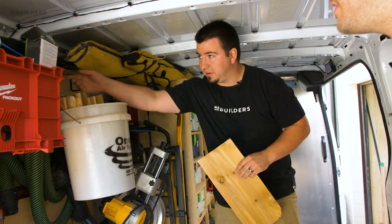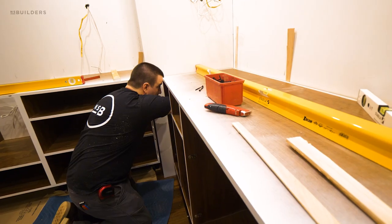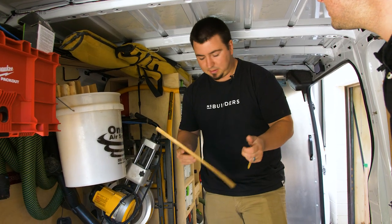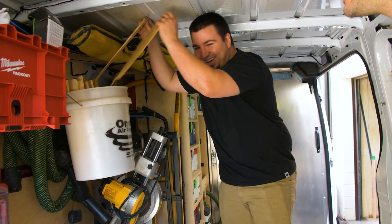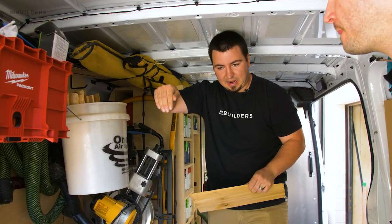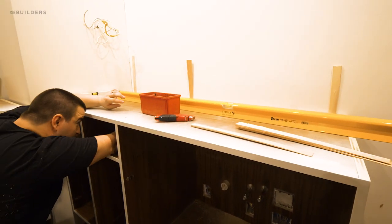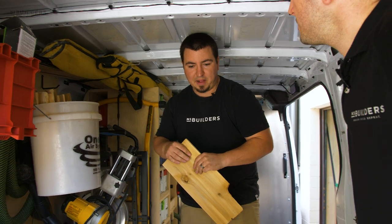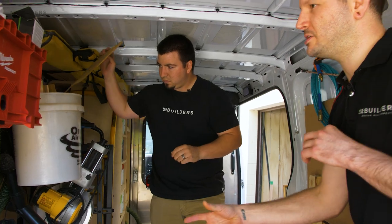When your cabinets are going to be tilted out off the wall but they are level and plumb, you never want to screw it to the wall without something behind it - whether that's a flat piece for a consistent gap, or I have some eighth-inch stock up top for that. Generally speaking the wall is going to move around a lot, especially on long runs of cabinets. We'll either cut these shims or break them off in pieces and make sure they're tight behind the case as we screw them in. Sometimes it does suck a little tighter than you thought, so you back the screw out, give it a little more, and plan for being plumb once your shim is in and your screw is tight.